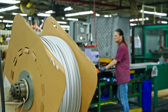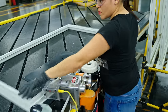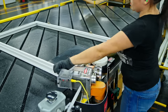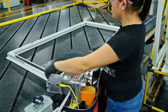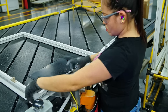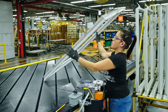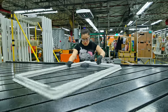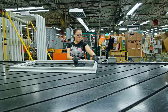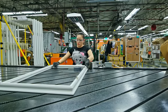One more thing to show you — single-piece weather stripping. It's fed out of a large spool and installed around the entire window in one piece. At the very end, there's an angled joint — essentially a scarf joint — placed at a specific location based on the type of window. For an awning window it'll differ from a casement, but they've figured out where the area least exposed to the elements is to put this joint. Before they did this in one piece, it was done in four pieces. Your seams at the corners are the most vulnerable part of weather sealing, so having one piece around the corners helps immensely.